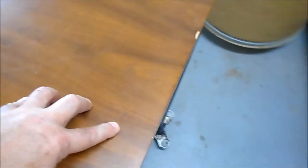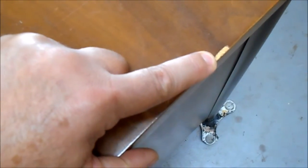I have the mirror that goes with this. It's also walnut and rosewood, but you can see here from the corner we have a veneer chip that has to be repaired. We have just some basic wear that we can clean up, some veneer damage to the drawers, nothing really spectacular. We have a piece of missing veneer right here on the rosewood, and there's two ways of fixing that, obviously. Number one, we can just use some putty and color, but I actually ordered some rosewood veneer, and we're going to do an inlay on this piece. It's going to be a really difficult clamp because this is curved.